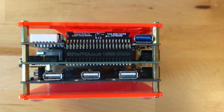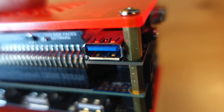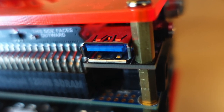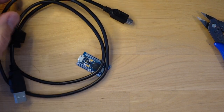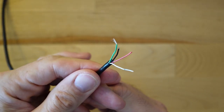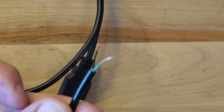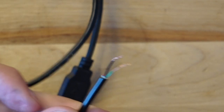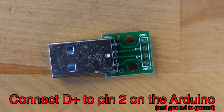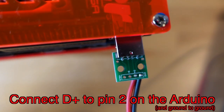You're going to make the return cable using an old USB 2.0 cable. The port at the side of the IO board looks like a USB port but isn't actually USB — it's just a convenient plug that uses four data lines. You need to cut the male end off, and of the four wires inside, connect the green cable to pin two and the black cable to ground. Alternatively, you can find cheap USB breakout boards on AliExpress for a simpler solder and wire job.